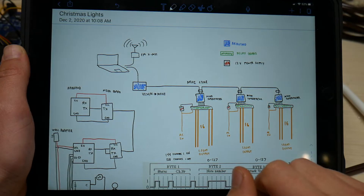So this is the Christmas light setup here. I've got my board there with the Arduino MIDI input and relay board, and I have this MIDI cable going through a MIDI to USB cable down to a USB extension that goes to my laptop down at the end of the driveway. Here's a basic idea of what's going on inside my Christmas light control system.